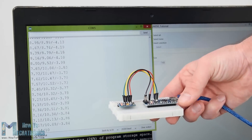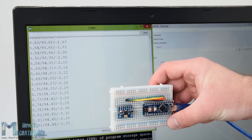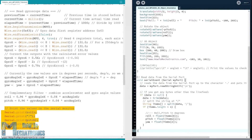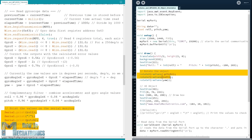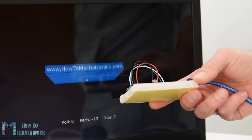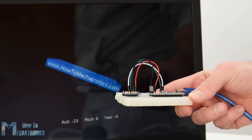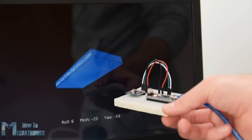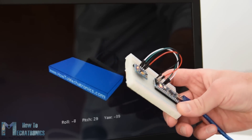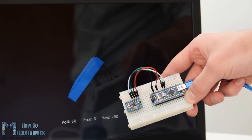In order to make the 3D visualization example, we need to accept the data the Arduino is sending through the serial port in the Processing development environment. We read the incoming data from the Arduino and put it into the appropriate roll, pitch and yaw variables. In the main draw loop, we use these values to rotate the 3D object — a simple box with a particular color and text on it. If we run the sketch, we can see how well the MPU6050 sensor is for tracking orientation. The 3D object tracks the sensor orientation quite accurately and is very responsive. The only downside is that the yaw will drift over time because we cannot implement the complementary filter on it.